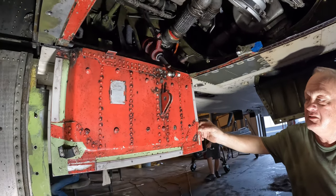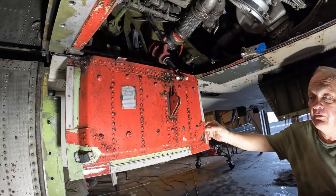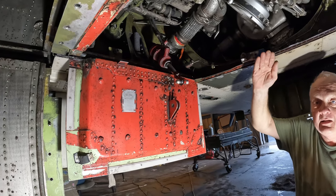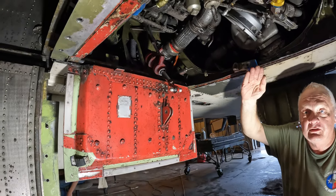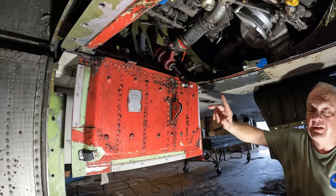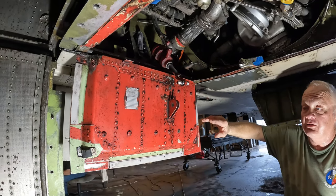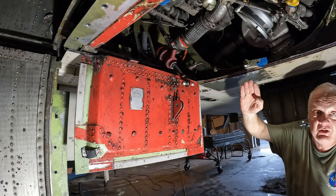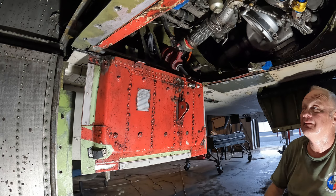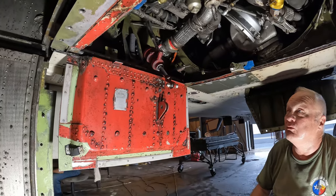This door right here is the auxiliary air door — commonly known as the aux air door. It provides cooling air on the ground or when there are certain pressure conditions inside the engine bay. It usually stays closed and flush, then opens and closes depending on demand. The dangerous thing about this door is the 3,000 PSI hydraulic system is not regulated on this actuator, so if it loses generator power it slams shut — if any part of your body is in there, it's coming off. This thing eats fingers.